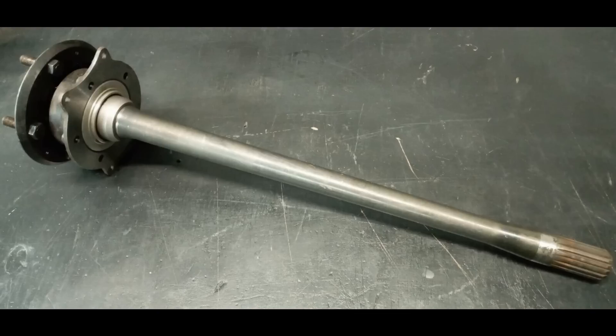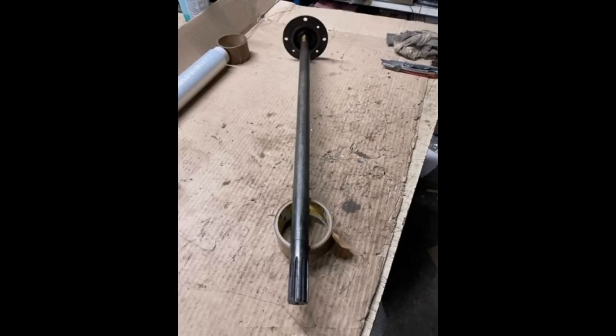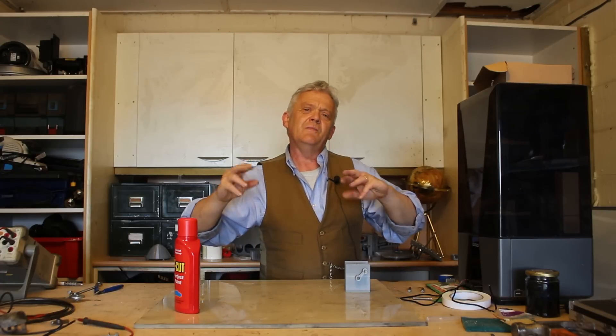For years what Rolls-Royce had been doing was mirror finishing their axles. A Rolls-Royce rear axle is in fact a thing of beauty and you can comb your hair in it. The standard axle is lathe finished and looks smooth but it's anything but smooth. A Rolls-Royce axle is much, much smoother, so as it does that twisting there's no point for the stress crack to start — the stresses are more evenly spread along the axle and it lasts longer.